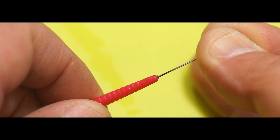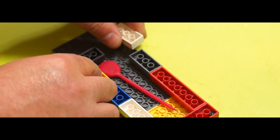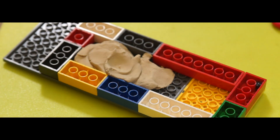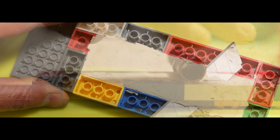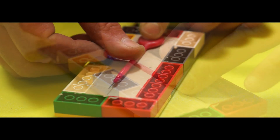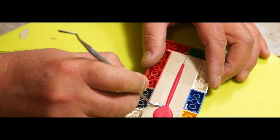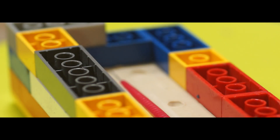For the other end of the worm I needed to add a vent, so I heated up a sewing pin and pushed it into the end, then cut it off with pliers. For a mold box I borrowed some Lego from the kids, put a layer of blocks upside down onto some boards, then filled in the area with plasticine or modeling clay and rolled it flat with a bit of pipe, trimming off excess with a craft blade. I pushed the master into the clay pressing it down until it roughly reached halfway, then used a dental tool to push the clay back up against the body. With the end of a paintbrush handle I added some dimples as keys to lock the mold together later, then added two more layers of blocks and painted on a thin layer of Vaseline over the clay and up onto the Lego, keeping it off the worm.